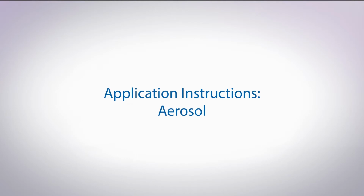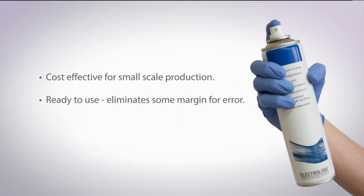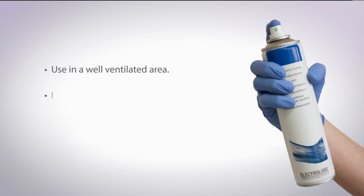Aerosol. Aerosol coating is one of the more cost-effective ways of application for small-scale production or prototyping. Most aerosols come ready to use and are designed to eliminate some of the potential problems that you may find with atomized spray guns. Application should always be in a well-ventilated area, but where outside contaminants can be kept to a minimum. We would advise a specialized spray booth where possible.